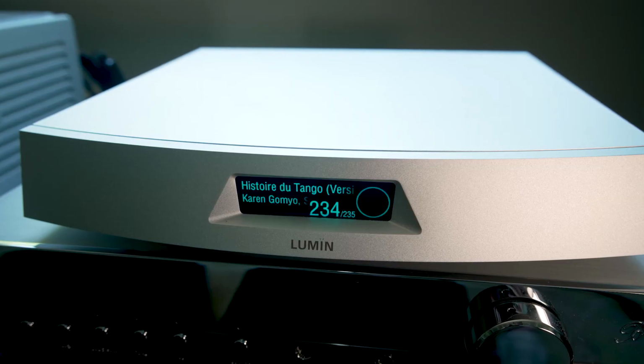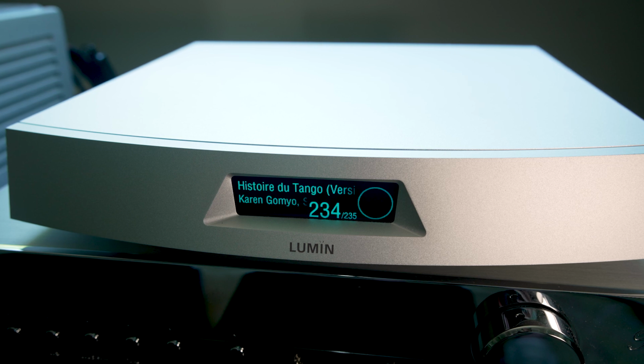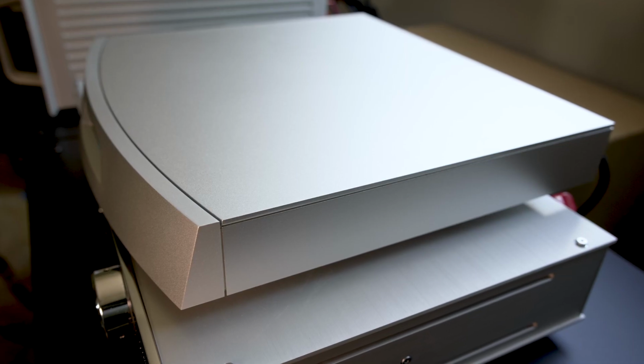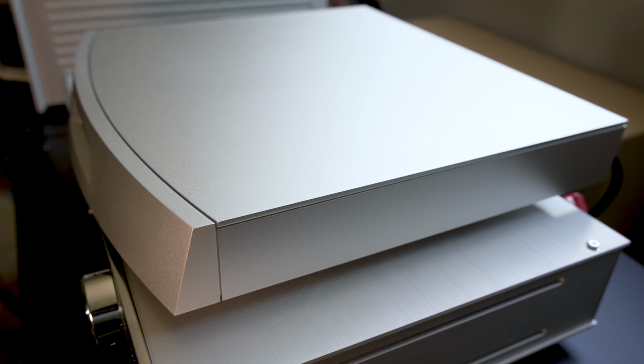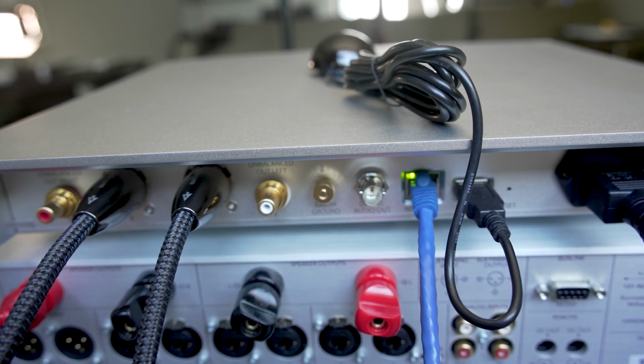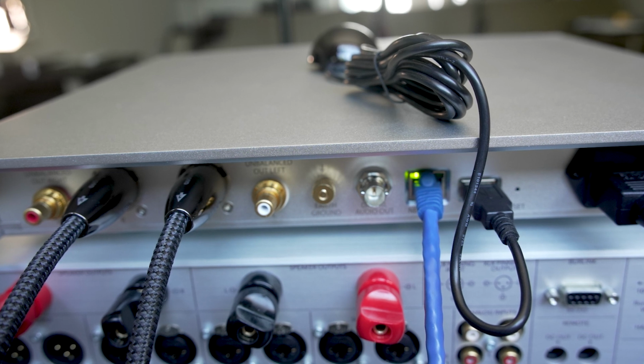So you've kind of eliminated the cost of a preamp and any damage that the preamp does to the signal. What you're replacing that with is whatever damage the final amplification circuit in the T3 and the LEEDH volume control do to the signal. But the theory is that's less damage than a preamp might do. And that's partially because, if you think about it, most DACs have enough output voltage to drive your power amps to full output, so the preamplifier is an attenuator, not an amplifier per se, and therefore it isn't 100% necessary. It's largely, if it's a good one, a super low damage switch and impedance matcher.